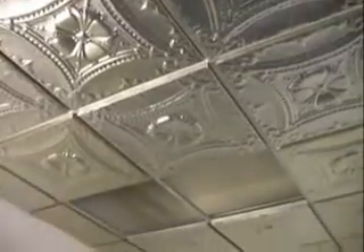We're about to finish a couple of these. I'm going to get up on this ladder to show you — no ceiling ever ends on 24 inches, unfortunately. So the outside grids of a drop-in ceiling are always going to be irregular: 3 inches, 6 inches, 10 inches — whatever was left over after they centered the middle line down the room.